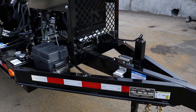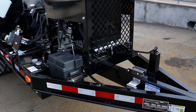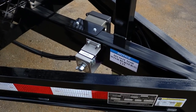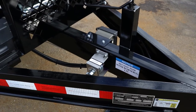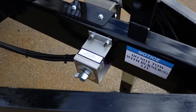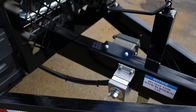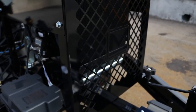In regards to proper procedure and operation: the battery disconnect switch is always the first thing you're going to do, so you'll turn your battery kill switch on. Normally you want to start your engine first so your charging system is charging while everything's on and you don't have any significant draw on the battery. But for this video, we're going to start the engine last because it is noisy and you probably won't be able to hear me anymore.